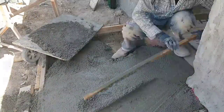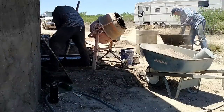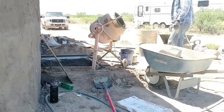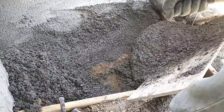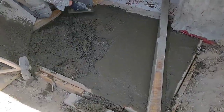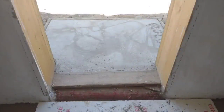I'm working on the mixing side and Kyle is doing the spreading. This time he's being careful not to crawl around in it and trying to keep it off his skin to avoid any chemical burns. The gravel we're using is a little unusual — probably wouldn't be our first choice, but it's free so we're using it. It's really small gravel and it makes the finishing process of the concrete a little more difficult. It's kind of difficult to get out of the mixer — we have to scrape it out by hand after every batch. It's also difficult to finish because it's hard to make the rocks settle and get the cream to come to the top for a smooth finish. But with a lot of effort, we got a completely acceptable finish and we're glad to move on to the next step.